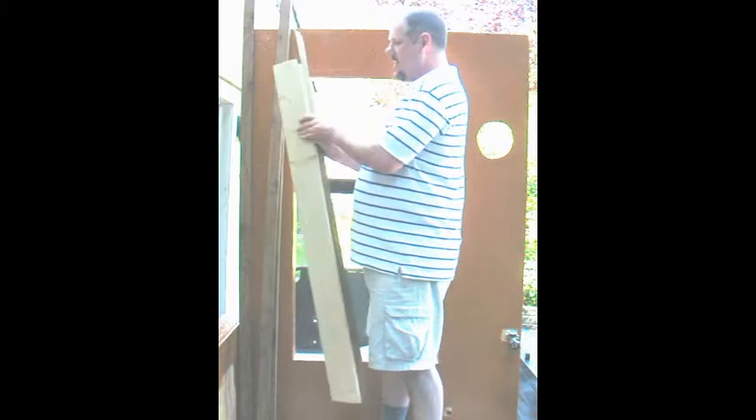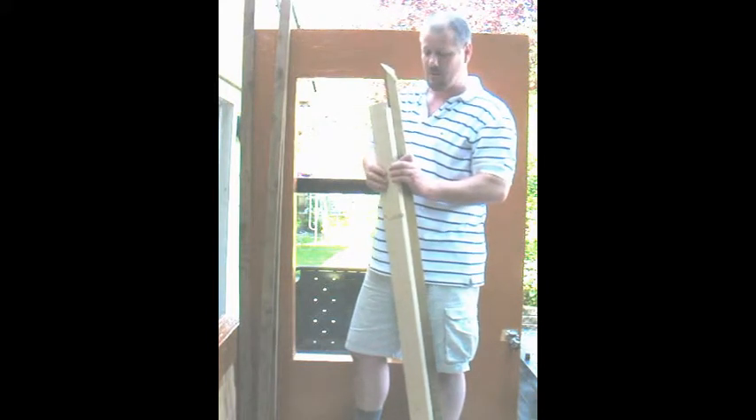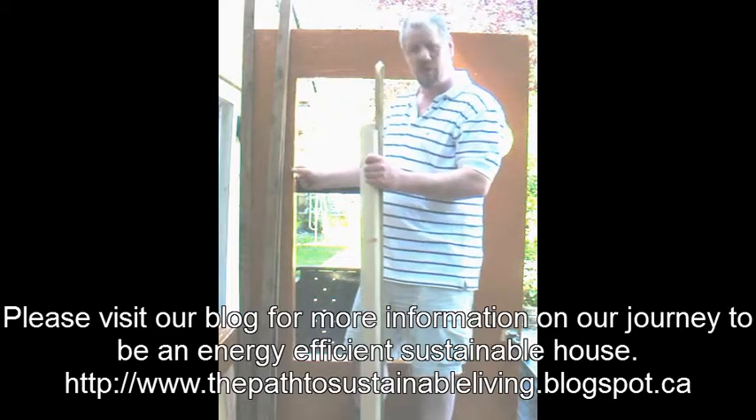Now you have a nice neat hidden look. The instructor at BCIT, James, was talking about this — you can extend your trim board past your return so the return almost becomes hidden, giving a nice neat finish around the window with no visible caulk joints. You never want the return flush with the outside edge of the trim — that looks a bit tacky. You want either a slight rebate or extension, either way giving a nice look.